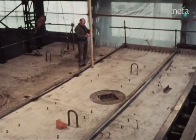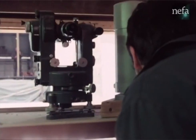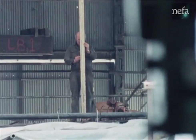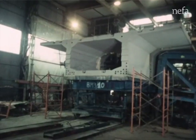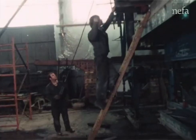The segments are countercast in the contractor's casting factory on site. Accuracy is the key. The concept, based on a series of glued joints, means that surfaces have to match perfectly. This is done by countercasting each new segment against its predecessor, and at the same time the curve of the deck is created by the angle at each joint.